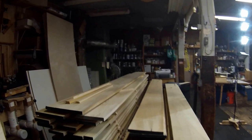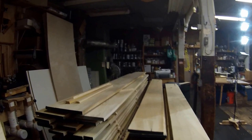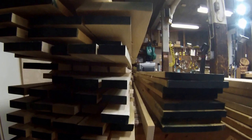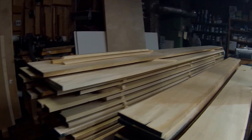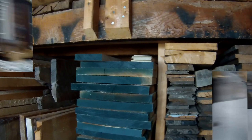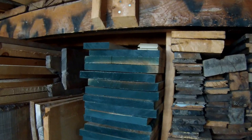Then I stickered it again and let that sit for another few weeks. I got each piece close to its finished dimension in thickness and width, then let it acclimate with the heat on for as much time as possible. It's hard to say how much time wood needs, but this wood came in pretty dry — it was dried properly at the mill, so I didn't really sense that there were any drastic changes going on.